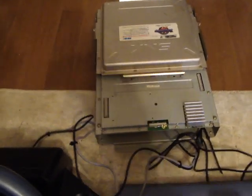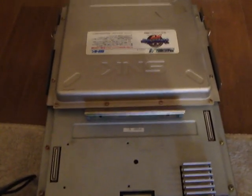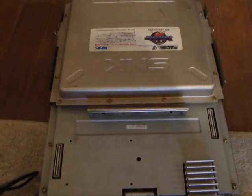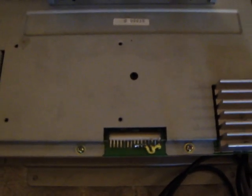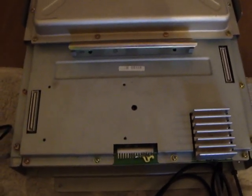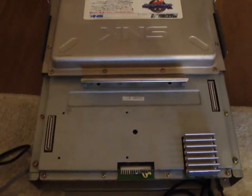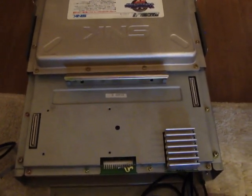Key point first: when you get your board and you decide to just normally hook it up, it's going to go into a network test mode. What you have to do is bridge some of the wires on the back — this is a 15-pin connector. If you don't bridge these wires, it'll just sit in that check mode and continue to loop through it endlessly.